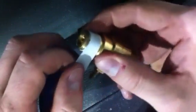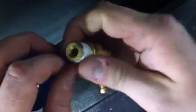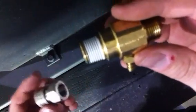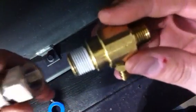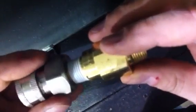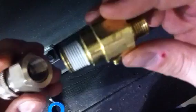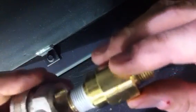And what we're going to do is we're only going to come around and lap it around. So I go about 1 1/3 maybe, and just break it off there. That's all you need. You don't need a lot more. And actually I feel putting more on, which is a good word for it, moron, actually creates a bad environment. I don't feel like you get the proper seal at that point.